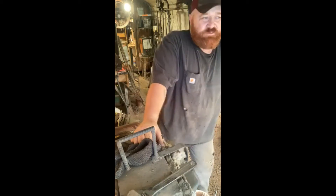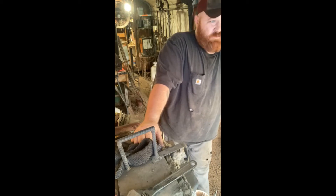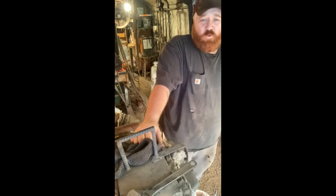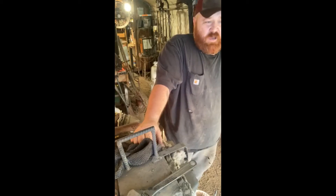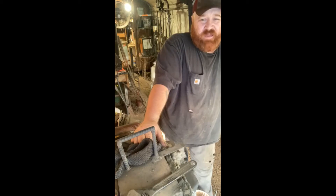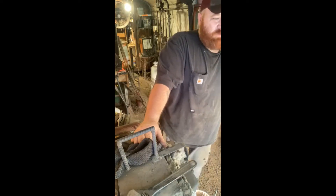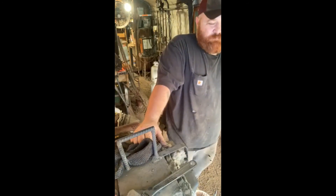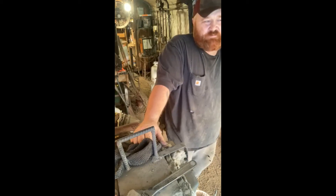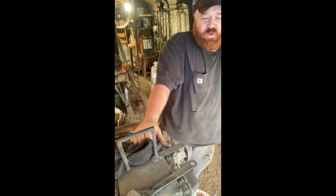That's why you use an inert gas in gas welders — it displaces the oxygen within that area for a given amount of time so your weld can seat. The same thing in forge welding: we put flux — I use 20 Mule Team borax laundry detergent. It creates a molten layer that protects your welding surface from outside air. A dry weld, when you weld all your seams and clench it down, creates basically the same environment as canister Damascus, where you don't use flux either.